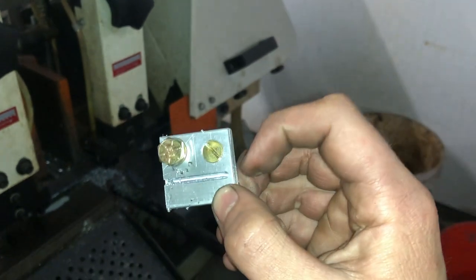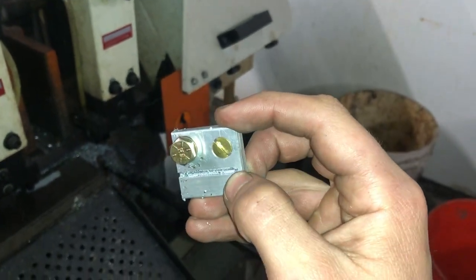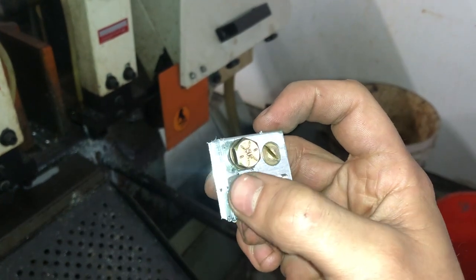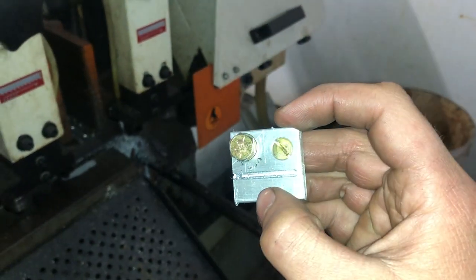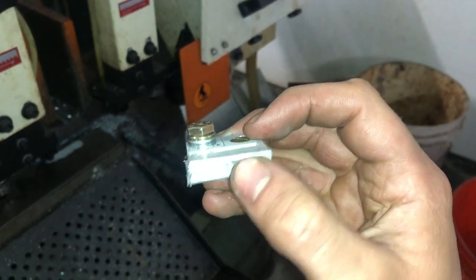Good, because this has a close side with the rounded slot ending before it gets to the end, and this side will open up with the 1/8 inch end mill, and we got two bolts holding it in, so this piece was a success.